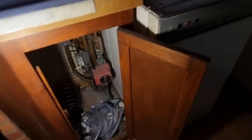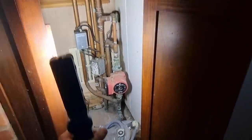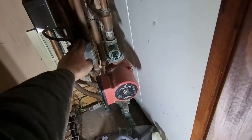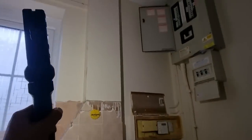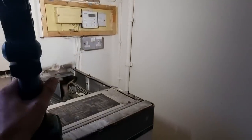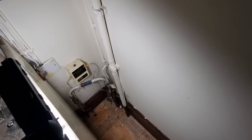I was going to try and get some heating on. Got all the heating controls and that under there. So obviously the hot water one, we'll have to make sure no towel rails come off it or anything like that, but that one there will probably be hot water. Goes up in that pipe box in. So obviously our cylinder's moving, it's not upstairs anymore. So it'll be dead easy to pick that primaries back up off the new boiler, mains water comes in there.